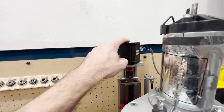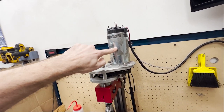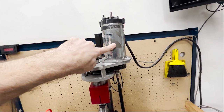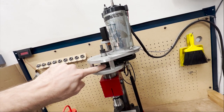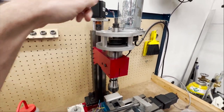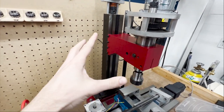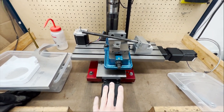This is obviously a super cheap motor, but we'll see if it works. And if you aren't familiar with my CNC, this is a treadmill motor — a DC motor that's like 130 volts, 6,600 RPM. I run it at around 5,000 RPM usually, especially if we're cutting aluminum. It has basically a 2.0 gear-up, so it ends up running the spindle at double the RPM of the motor — a spindle speed of 10,000 RPM. That's a 2-horsepower motor. It's decent, probably way overkill for this frame. There's not a whole lot of rigidity in this little mini mill, so I have to take fairly small cuts, but it turns out decent.